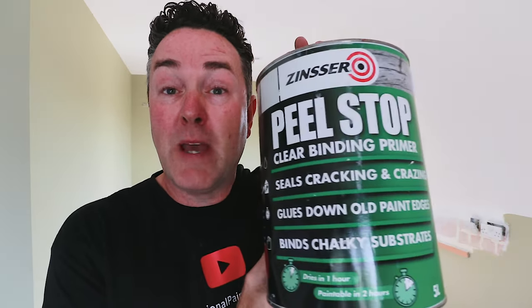Then what we're going to use is — we love it — Zinsser. What would we do without Zinsser products? We're going to use Peel Stop. Peel Stop is ideal when you've got a situation where you've got flaking paint or crazed paint. As always, please read the back of the can. Today's use of it is to seal what we call a mapped edge. If you've got walls that had wallpaper, stripped them off, and they had previous coatings of emulsion...